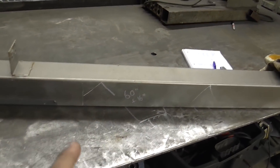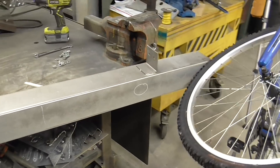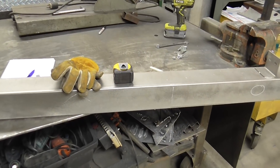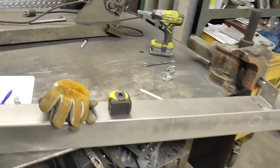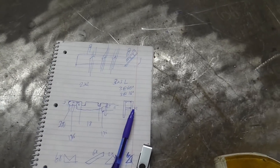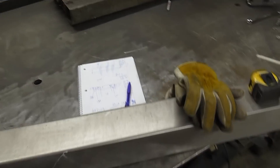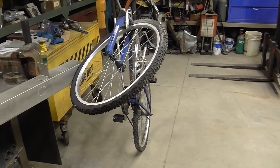Here's the original bumper that holds the discharge holes. We laid some angle iron out on the bumper so the new part is going to bolt onto the vehicle, and then the bumper bolts onto the new part. We designed a few brackets on paper, drew this all up, and we already have G-code to feed the table. Hopefully it'll look store-bought.